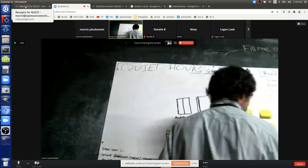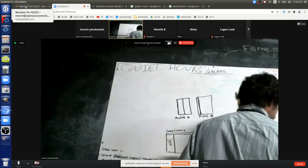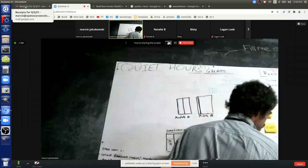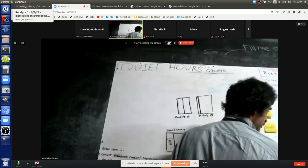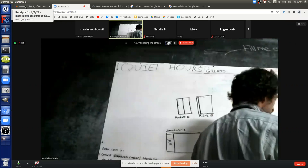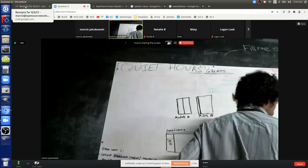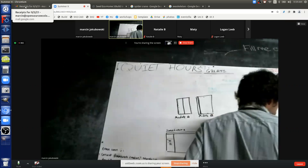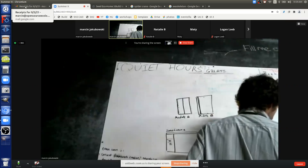So basically on the top plate, you've got your joints every so often. Say you take your 16 footer and span it, so it's like a 12 footer, but put it up there. You can never end up on the joist. So you just have to figure out the correct dimensions. Try to use pieces that add up to what we already have. To make it explicit, you do a 16. What adds up to that? We could do a 10, 2 and 6. Two and four?